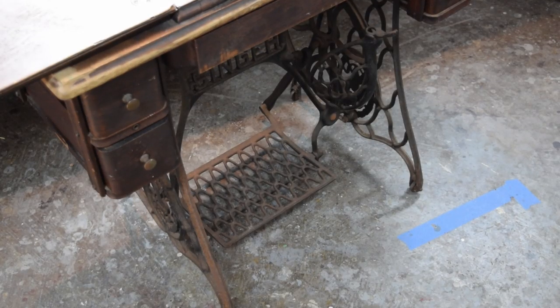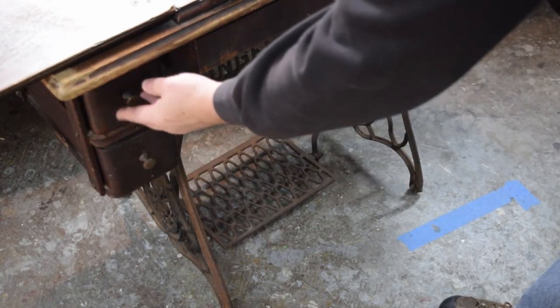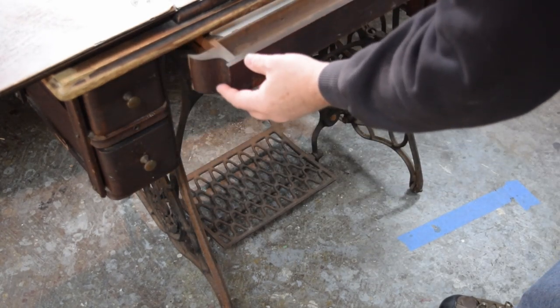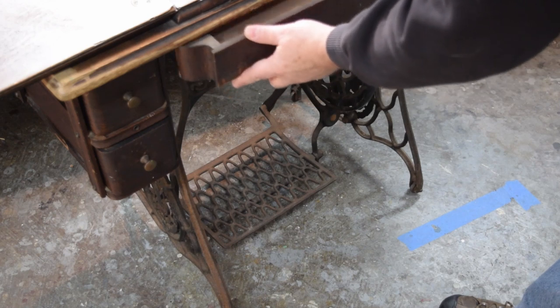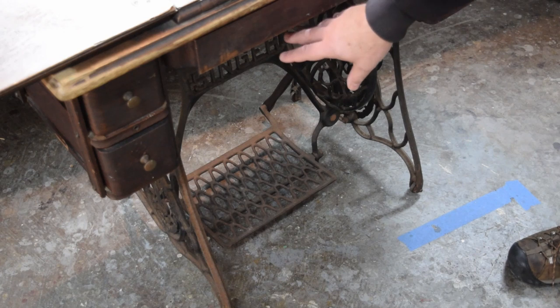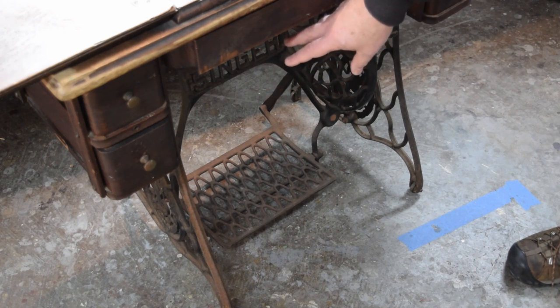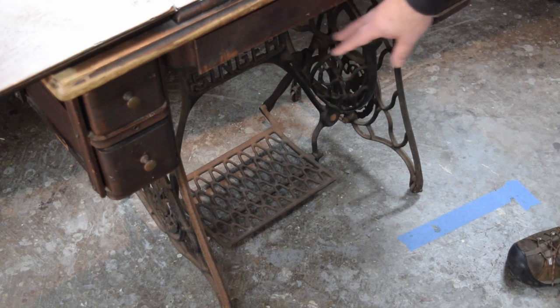As far as the drawers, they're in pretty good shape. They just need to be refinished. The center drawer is in good shape. It too needs to be refinished. And the issue with the base, and I haven't taken it apart yet to make sure that there's no pieces broken or missing, is just that the paint is gone and it's all rusted.